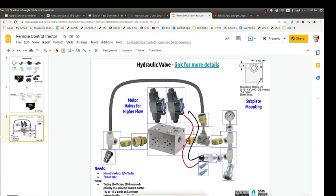But imagine a bug in the Blink app with a 3,000-pound metal machine doing circles — that's a real concern. You'd definitely do this in an open area first. For testing: plug in a cylinder, put it on a table, test the joystick extends and retracts it. Once confident, take it to the tractor. The joystick works as a dead man switch — you have to hold it to make it go; release it and it turns off.